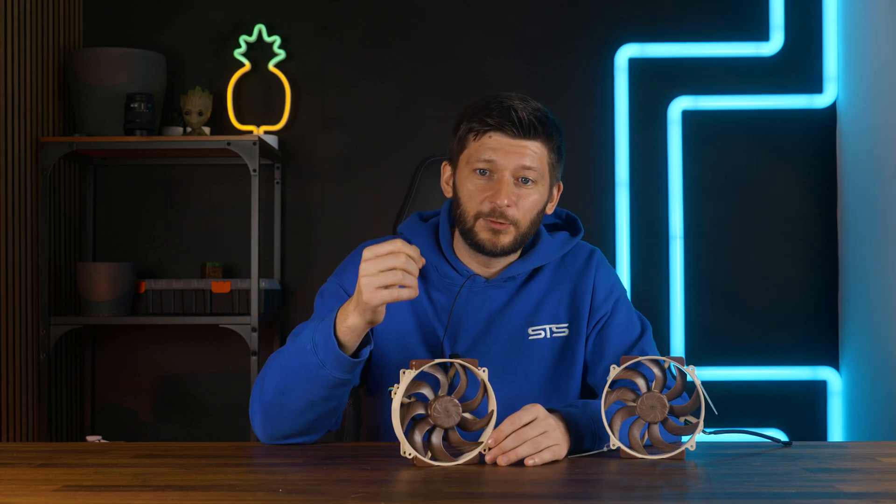With the A-weighting system, you will have a different emphasis on a given part of the frequency spectrum. So what can happen — and it did happen a few times already — is that if the type of noise shifts, or if it gets higher pitched or lower pitched, all of a sudden the dB meter will show you 2, 3, 4 dB more, even if you sitting in front of them can say it's exactly the same noise level. It's just higher pitched or lower pitched.